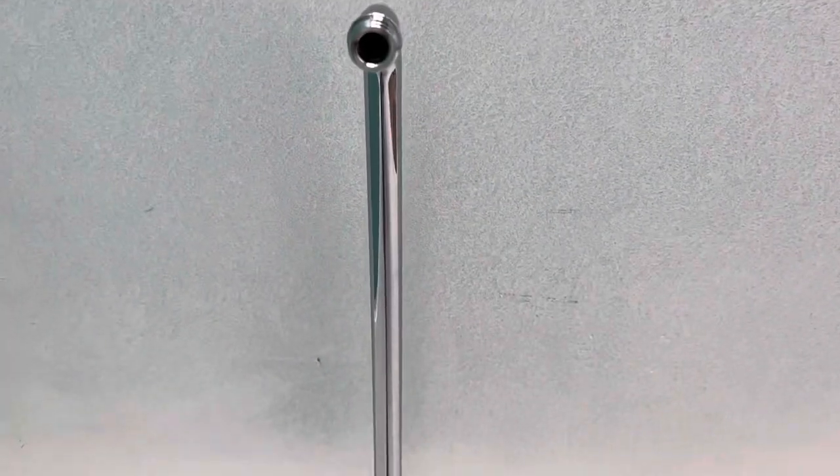Put our level on that, mark up that fixing point. This isn't really the right type of bath to be putting panels on because it's got such a chamfered edge - there's no flat edge for them to sit close to and then bead and silicone underneath. The panel kind of drops behind the curve of the bath and then we're going to have silicone on top of that. So if the silicone fails it'll sit in that little groove against the panel and if it soaks it up it'll blow them. It's not really the right bath for that, but who am I to say anything - all I got told was I was coming to fit a shower here, and now I've got to help do the rest of the panelling.